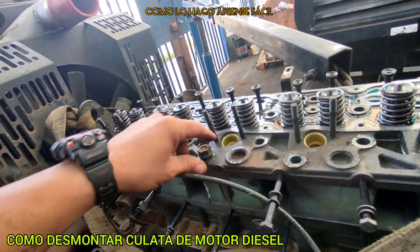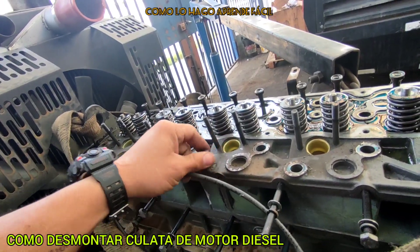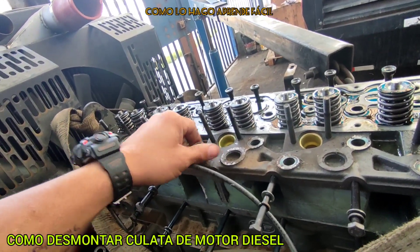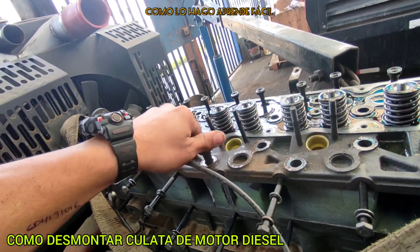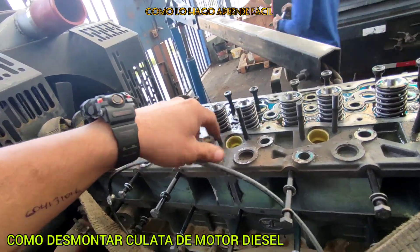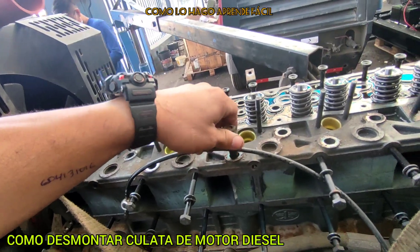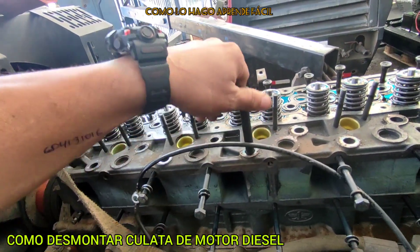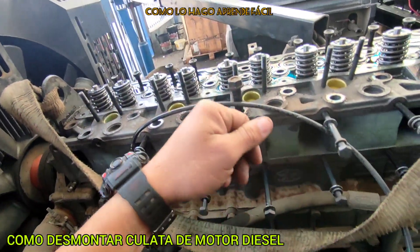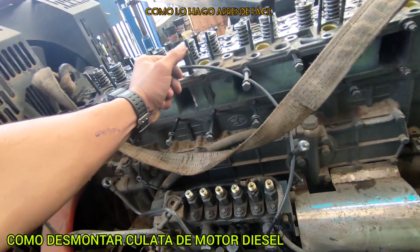It is well calculated — this unit is rated at 150, it should work at least with 130, but a machine should never work at 100 percent capacity. So it has not been properly sized for the load, and that is the most probable cause. The motor has had to suffer the consequences. Let's remove the culata and I'll show you.